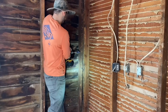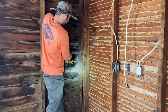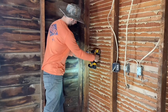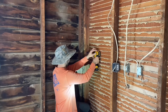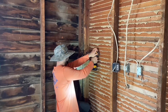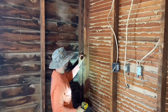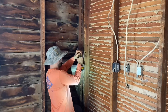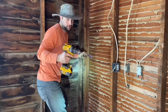I'm going to angle it a little bit when I drill through — slightly angled. Now I'm going to take it this way and make sure they're at the exact same height so you can get that wire in there easier. I'm also going to drill out right here in the middle, and that's so I can kind of fish it with my finger. That's a little trick for you.